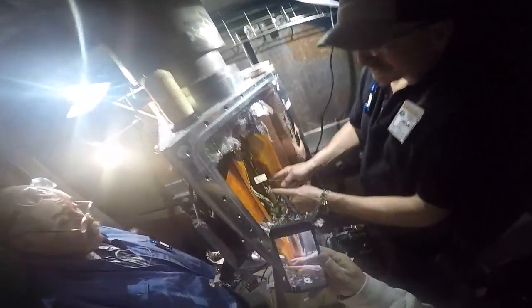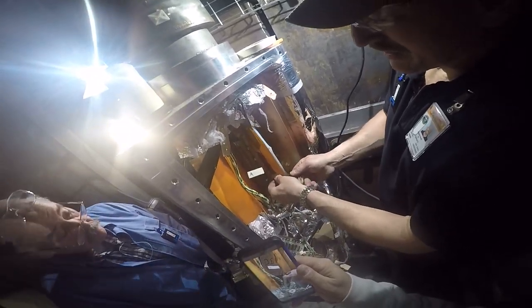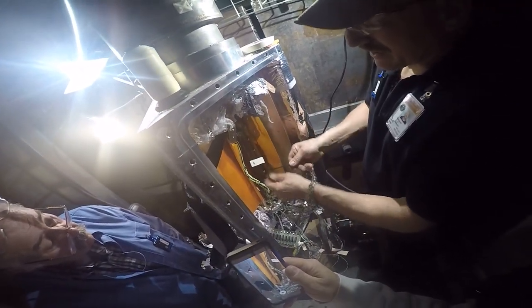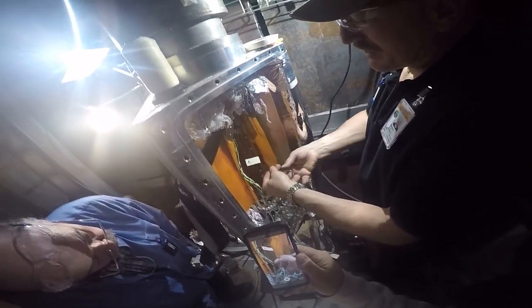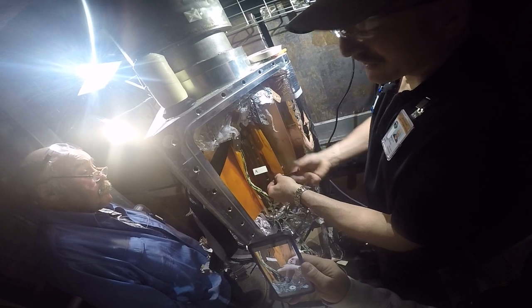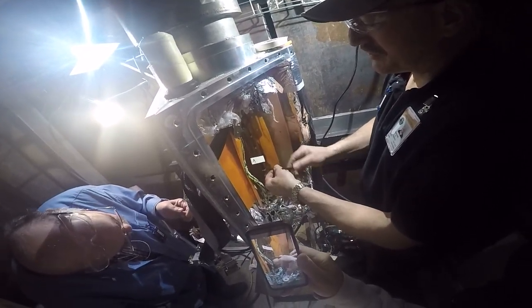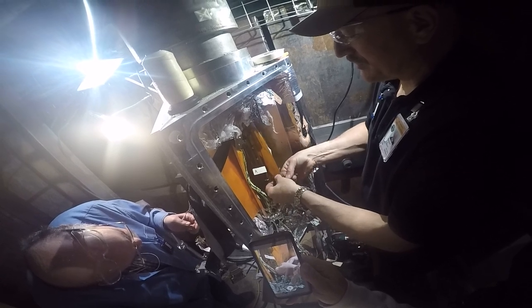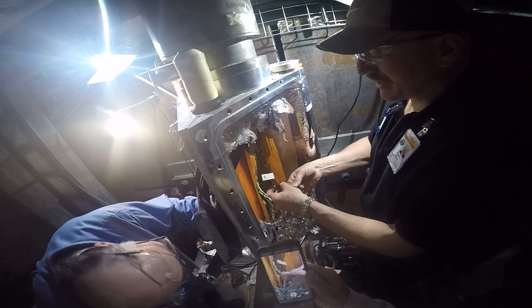So, all the screws are going to be the same, either this length, and there'll be 8 of them in there that are longer. And that's just for that extra plate, for that extra thickness that it has to go through. Everything else, I don't remember the lengths, but they were right. They don't poke through, and you got plenty of thread, so everything is funky spunky. Put a little thread dressing, a little grease or something on the thread, to help you out. Because you're going to be going up and down and tightening as you're squeezing that indium down, trying to make a full contact.